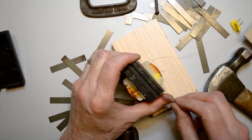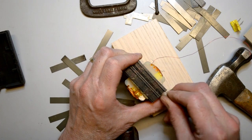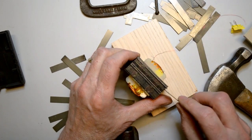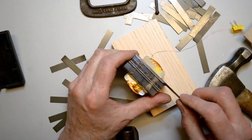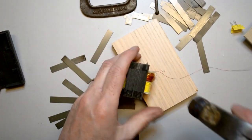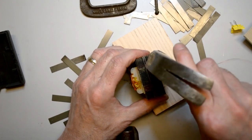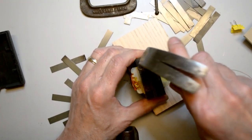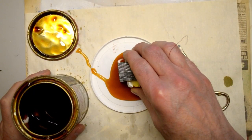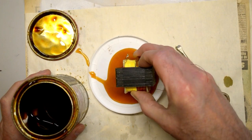Next, it was time to install the I-plates. Those are fairly easy to install — I just had to carefully install them between the alternating E-plates. I was careful not to scratch them, if possible, in order to keep the insulating layer on the outside of each plate intact. The insulation is there to stop electrical current from circulating around the core, which causes overheating and losses. In order to keep the transformer quiet, I soaked the ends of the laminations with a varnish. I let it dry and the core became nice and solid.